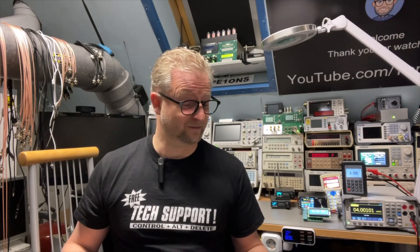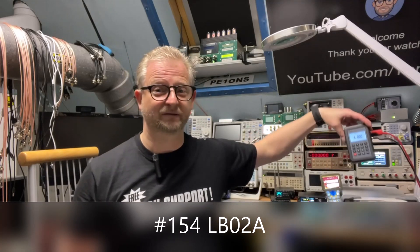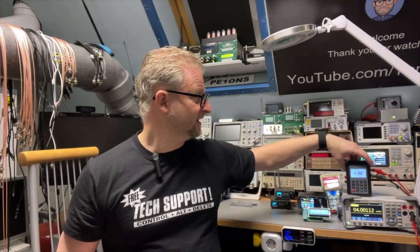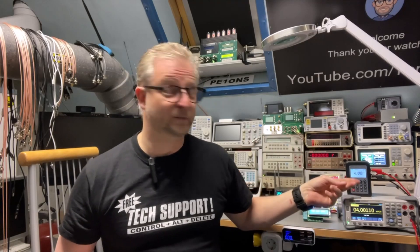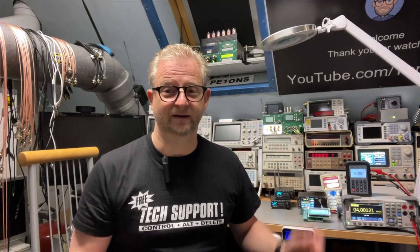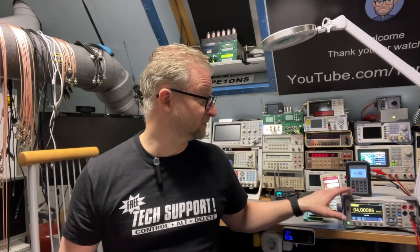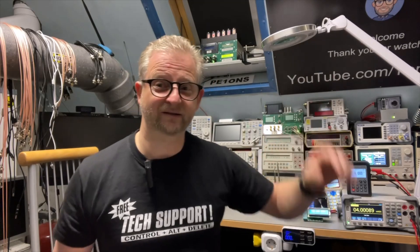I think this is Q&A number 9 already, and today we have a few questions. One is from Ricardo - he said you have this LB02 calibrator and it is also possible not only to do voltage and current, but you can also do resistance. He said especially on the lower values like 20 ohms - the lowest - your cables could interfere, and he's wondering how much current goes through it. It depends on the meter you're using, because that is the one actually providing the current. I have three or four meters and we can just see how much current goes through it.